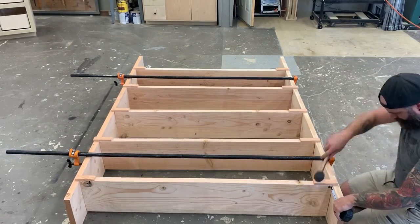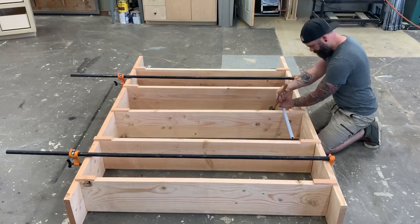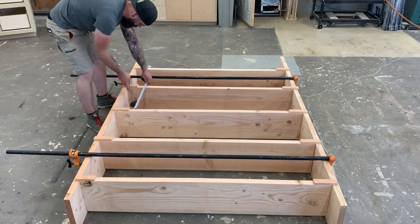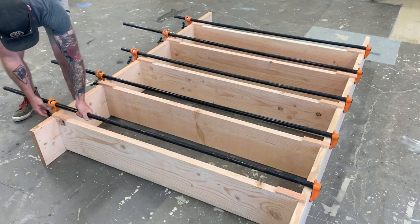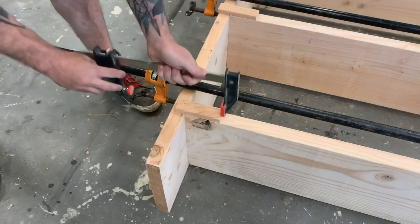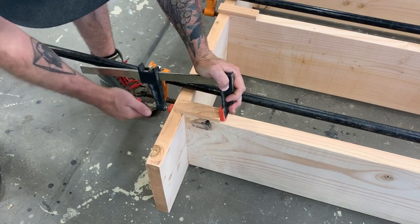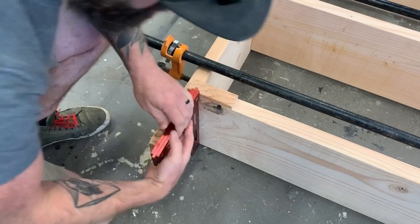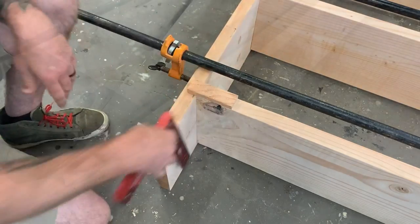This is the back of the shelf, so once I knock those scrap pieces off you'll never see the staple holes. I just take a rubber mallet and a tape measure, loosely clamp everything together, and knock each shelf into its appropriate location. I had extra clamps so I put one clamp for each shelf. If you don't have clamps that long, the little scrap pieces could also be used as cauls and you could just use small clamps right at the source.